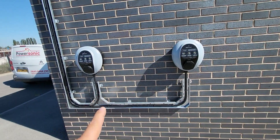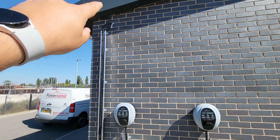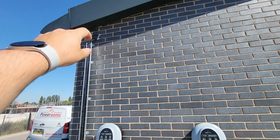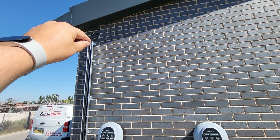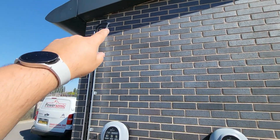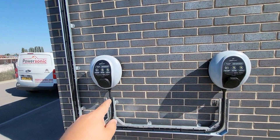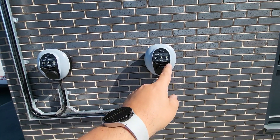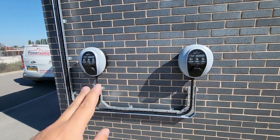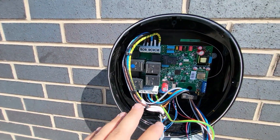Another school, and here are the two Pod Point chargers on the wall. You can see our tray up and away, cables exiting with sleeves through the wall. It's basically a bung that sits into the masonry and runs through the cavity, with a little drip loop — it's a way of making sure you get a fully watertight seal within a cavity. The cables go straight up into our chargers here. These are bottom entry. Nathan's going to open them up because we need to make sure we've done the phase rotation right and a few other little checks.